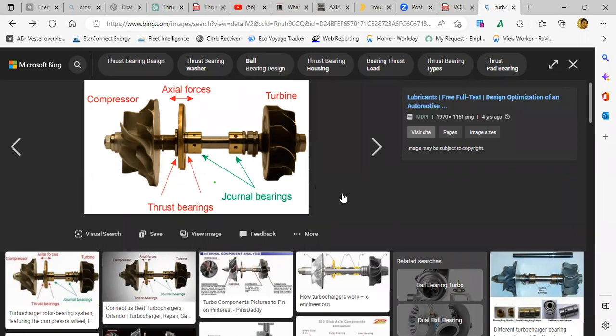See, normally when the turbocharger starts, initially there is no compression pressure, no scavenge pressure. The scavenge pressure is zero. So when the turbocharger starts rotating, all the gas force is here, correct? So the turbine has to move to this particular side. Now what happens? As the scavenge pressure builds up, the pressure will try to equalize here and push it on this side.